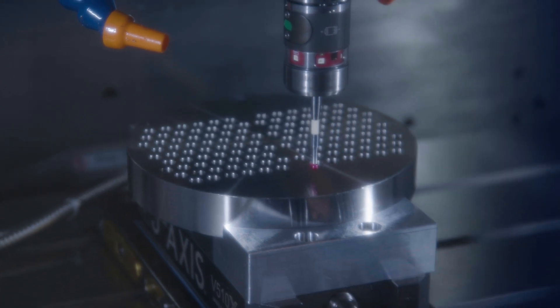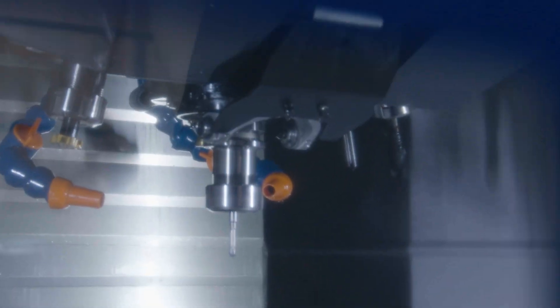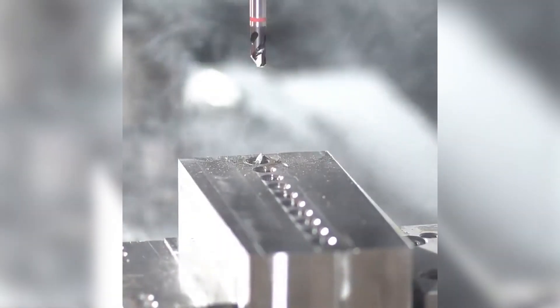With the LC50 Digilog laser, you can fully set your cutting tools — no previous data required. It's all preset and set on the machine tool, and all the tool offsets are automatically updated. From that, we can control your tooling, so we're looking for wear, for breakage, and monitoring throughout the whole process.